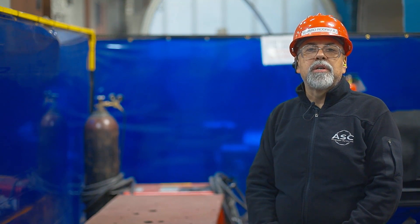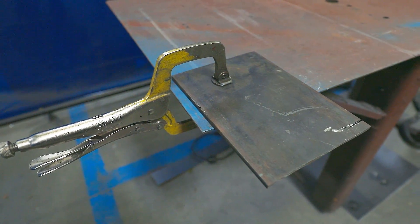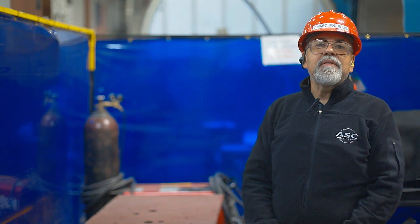Now that you've learned what to do first, you can begin to cut material. You must start by ensuring the workpiece you will be cutting is properly clamped to the table or work surface. This is important to avoid too much movement of the workpiece, as too much movement can damage the wheel and can cause the wheel to break or suddenly jerk, which can lead to injury.